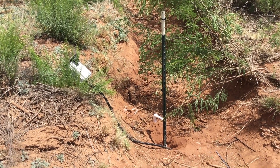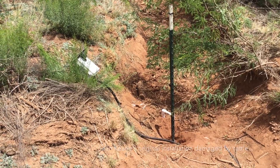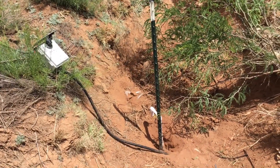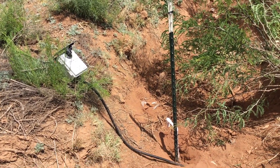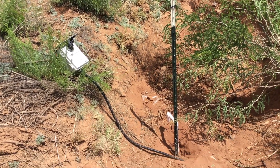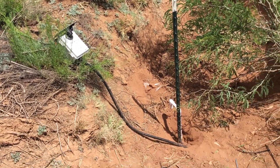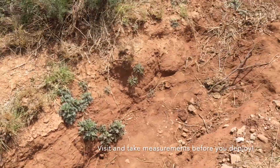I'm here at a site that suffers quite frequently from sanitary sewer overflows, so we're going to set up one of these remote environmental monitors in this little wash where everything accumulates. I made a few mistakes with respect to this installation. For one, I didn't scope out this area before coming out here, and I didn't have enough conduit and wiring to actually put that T-post outside of the wash on the bank and then drop the sensor into the wash with the second T-post. I wasn't expecting to find this entrenched channel here.